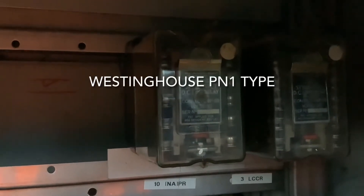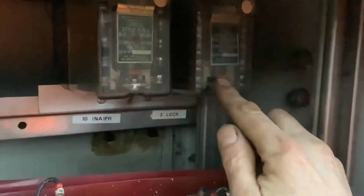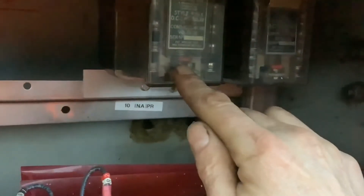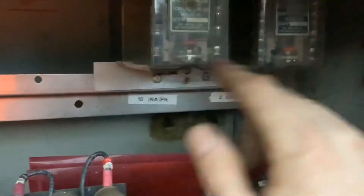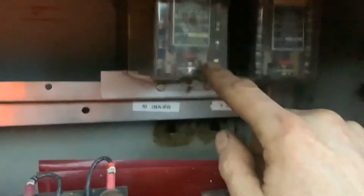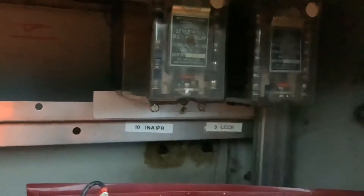This is the Style PN1 DC line relay — a miniature version built in the 1950s, 60s, and 70s. As you can appreciate, they're quite tightly packed in the cupboard. Some of them have a telltale indicator on the front, but what you often find is a little red mark on the armature — quite handy for working out which one's up or down. This one is up; this one is down, and you can notice the back contacts are broken on one and the front contacts are made on the other. These are small, simple relays — great for fitting in cupboards. A lot of them were made redundant on the west coast modernisation. They're held in with screws at the back of the relay block, have black bases, and a small PN1 blue base below.